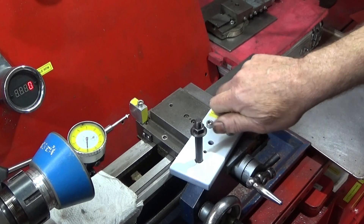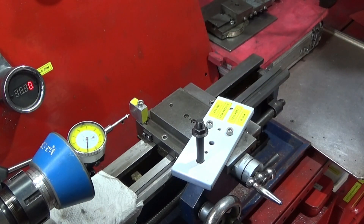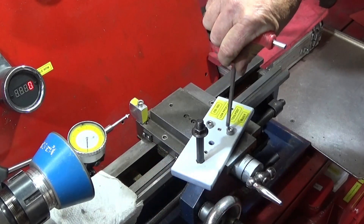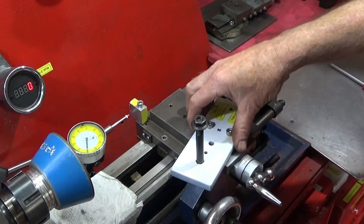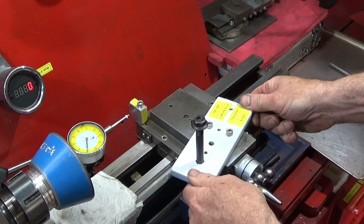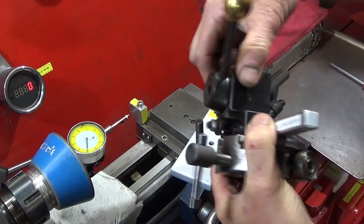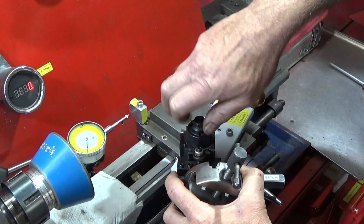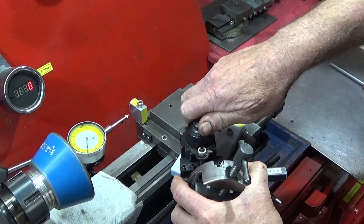I've marked the position of the angle already to make it quicker. The angle of the plate on the cross slide doesn't matter - it's really just for positioning and getting it correct for clearance from the hand wheel or whatever. And then the tool post goes on. Just nip that one up because you'll need to adjust the angle for the tool.